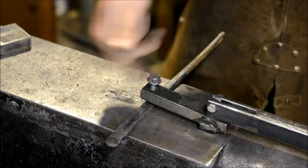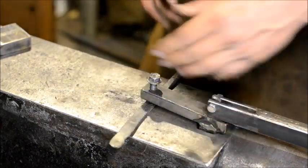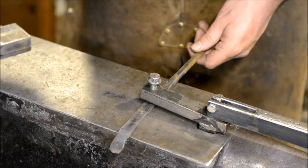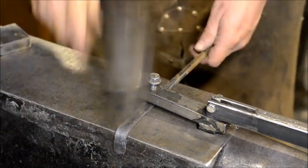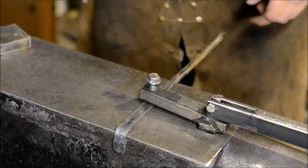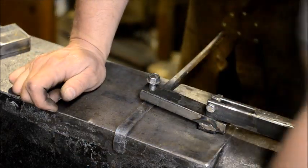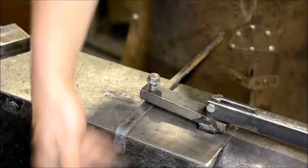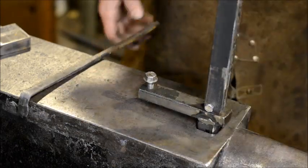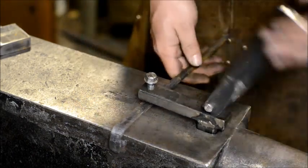This little thumb screw can be adjusted however needed and then it holds your material. The other big advantage — you can hammer on the edge of the anvil material. That was eighth inch material, half inch wide, forged cold at a right angle over the anvil surface. With a regular hold down tool, when you hit this way they're subject to that vibration popping them back up and out of the hole. With this tool — remove the material, put it back, find your spot, and it's locked in. That quick.